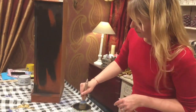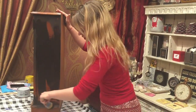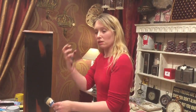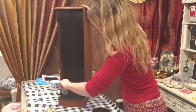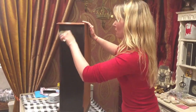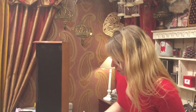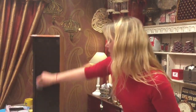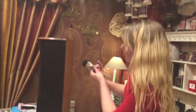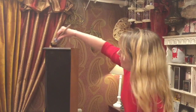Are you putting that on quite thickly? I vary my style - I'm probably not putting too much on right now because I don't want it to slide since it's a little bit glossy. It's very easy and quick, and you don't have to be as careful about brush marks as with another form of paint. With chalk paint, worst case if it does come out with brush marks, I quite like that because it shows you've done it intentionally. If you do find too many brush marks, just take a bit of sandpaper to it when it's dry and buff it off.